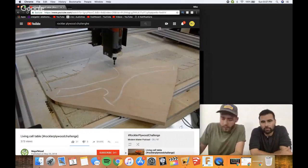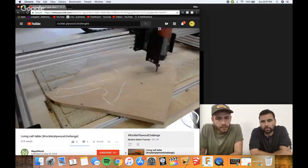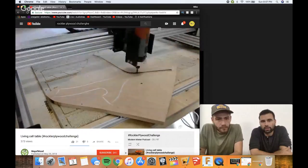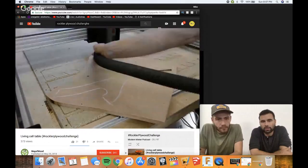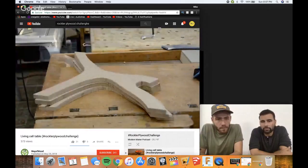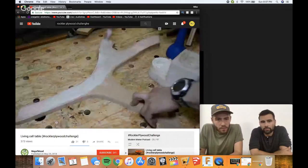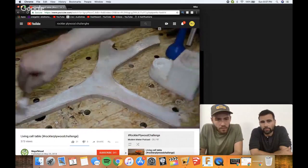I follow the shape with the CNC electrical switched off to align the plywood. Then I cut a channel in the middle of the piece and also cut the outline with a freehand bit. The second half is temporarily attached and will be treated as all the other pieces. For all other legs, the 2 halves are glued together.